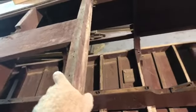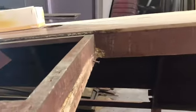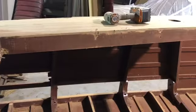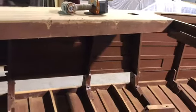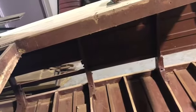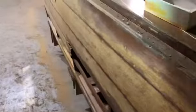The frames are oak but the top sections of these boats are all mahogany, and there's localized rot in that corner and the same in this corner on this side of the boat — just under my finger here. We're going to remove this section of timber and replace it with all new timber. It'll smarten up the side of the engine room as you look in and get rid of that localized rot. Looking down through there you can see a hole in the side of the boat — these boats are always stored stern down and all the water sits in the boot.